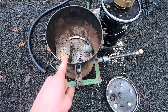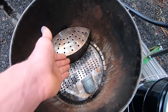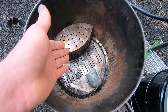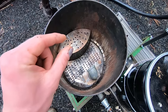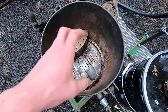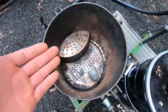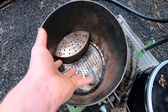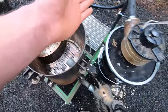And so the way we're taking advantage of that here is by burning material, but not completely. So we're burning it in an oxygen-deprived environment, and that flame, the ignition of some of the material, is enough to create heat. And that heat, which is sustained through just enough oxygen to not spread to ignite the gases produced by the heat interacting with the surrounding material, is the process that we're using to create wood gas. But basically, small flame, heating around it, but not giving enough oxygen to burn. And then those gases are then taken through this grate and then filtered through our system.